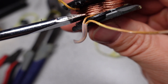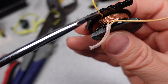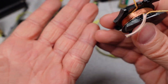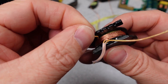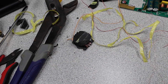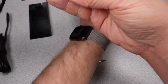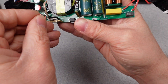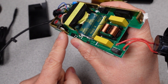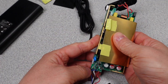I am curious to see how much capacitive coupling there is between the primary and secondary sides with this device. The turns ratio is fairly low, and it has to be since the universal input voltage and lack of a power factor correction circuit means the voltage to the transformer input will vary. To support from 100 VAC and up, this device has to have that lower ratio. From a power supply perspective, it is a basic flyback topology converter and is actually a fairly simple device. There were some issues with the assembly side of things that make it a little less safe than it should be.